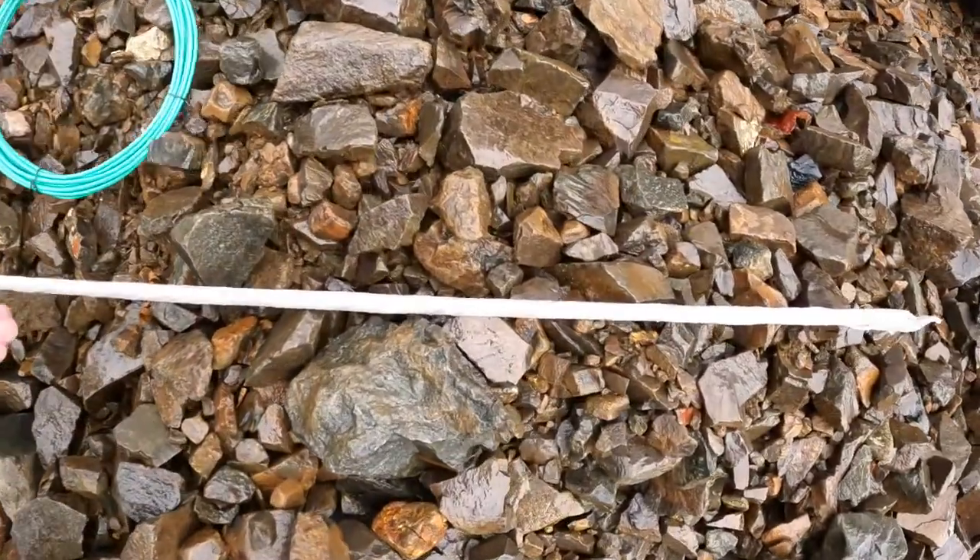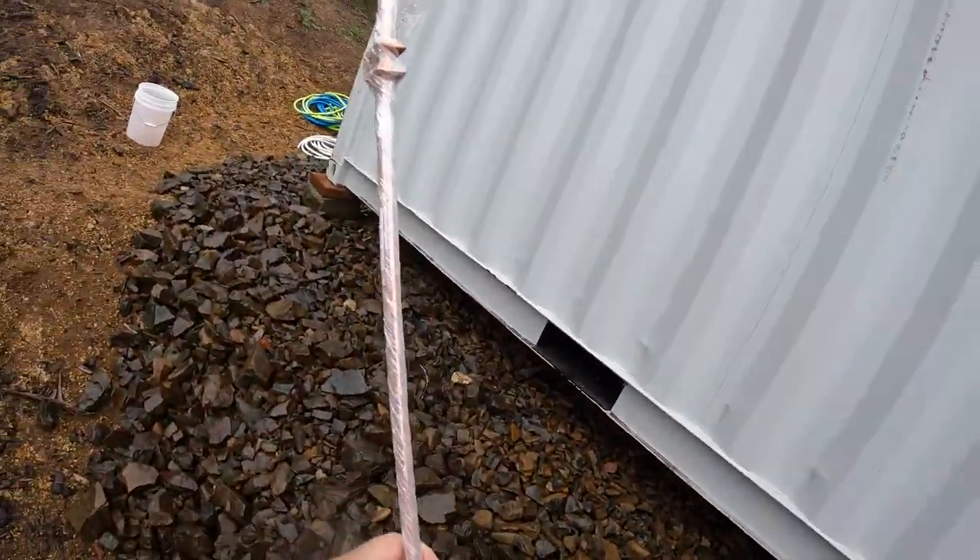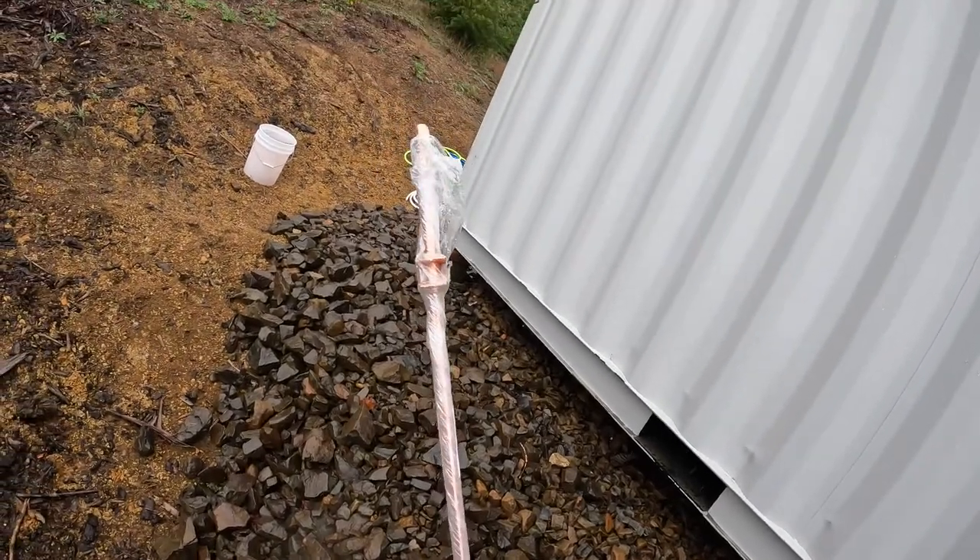Grounding rods are on every electrical system. You have one at your house — you just probably don't see it. If you're over by where your electrical panel is, you might see a little tiny copper nub sticking out with some wire, or you just see green wire disappearing into the dirt. That is a grounding rod like this one. It's a copper rod three-plus feet long driven into the ground, which provides a solid earth ground to anything that needs grounding and helps prevent lightning strikes.